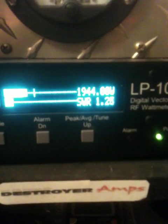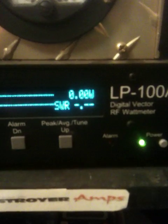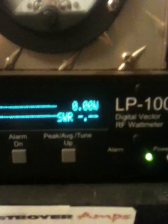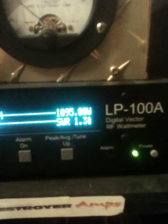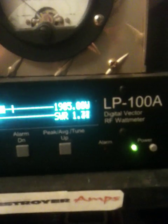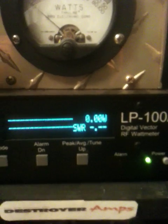Keying up for a test transmission. We have the SWR alarm set at 1.4 — it's a little picky here, we just want to make sure everything checks out. It's raining outside so we can get a little more reflected power than we'd like. Output is reading about 1900 watts. Not bad.